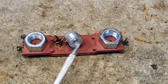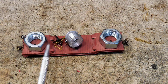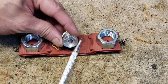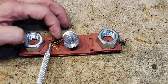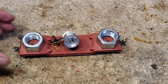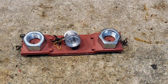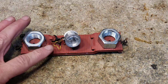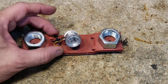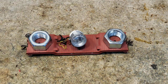Because this is an incandescent light — in DC you can switch directions and the light still goes — we take the two wires that go into the spotlight, put those on the plus and minus of the rectifier, and it doesn't matter which way. That is all there is to it. Now if we put this on a DCC track with the power on, the bridge rectifier will turn the AC power into straight DC and send it to the light. Then we can roll it around and detect if we need to clean or not.